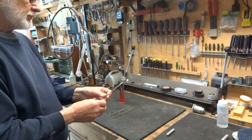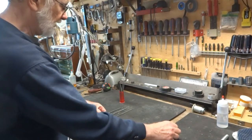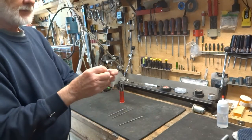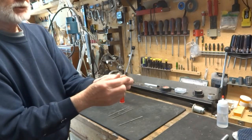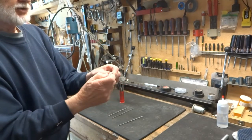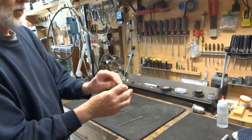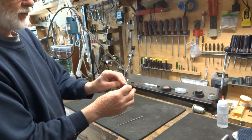So I wanted to solve the problem. What I did is I took a piece of half-inch aluminum and I made a file handle. It's rounded so it doesn't hurt you — just about the right size — and this size hole was drilled with a number 30 drill.